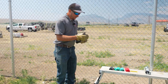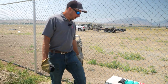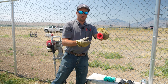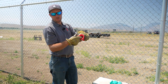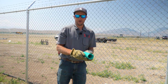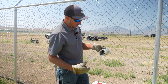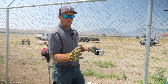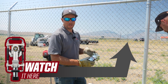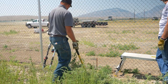So you have all these different adapters for pipe sizes. You can reduce all the way down to a ground rod — push down to a 2-inch and then down to a 3/4. So that will do a 5/8 or a 3/4-inch ground rod. The green is 1-inch and 3/4. Or if you go with no collar on the inside, you can go to 2-3/8. With the MultiPro XA, find the link below on driving Postmasters with the MultiPro XA. I would much rather use that any day.